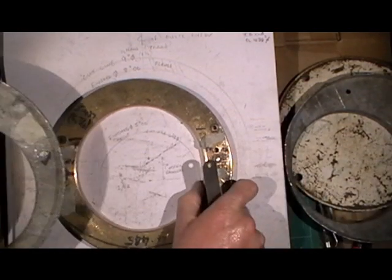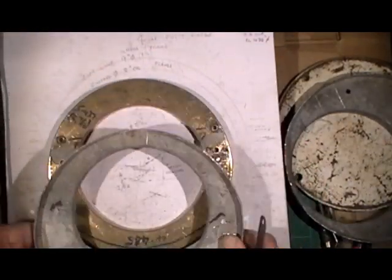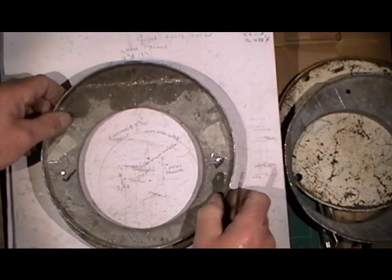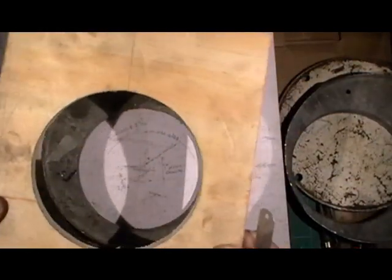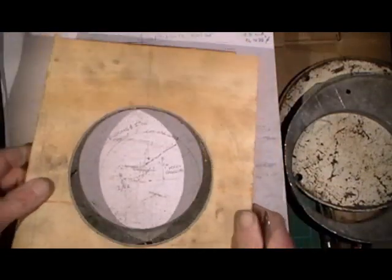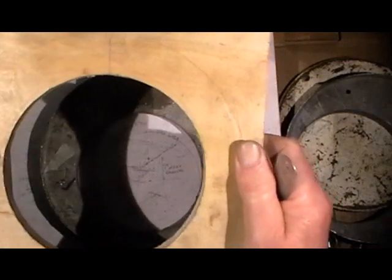Which puts me at one eighth above the center line, so I drill two holes one eighth above center again at six and a half centers. Then I can put my flange onto them locating pegs. Same piece of wood, same hole five and three eighths - clamp that and hammer that flange over, which I've done as you can see. That's what I've used to do me inner flange, just that piece of plywood.